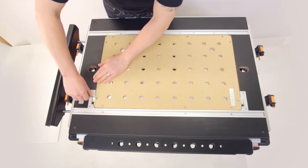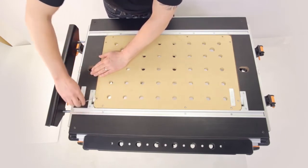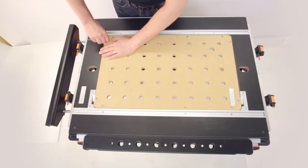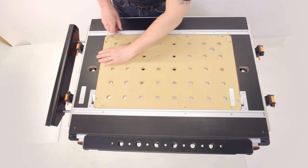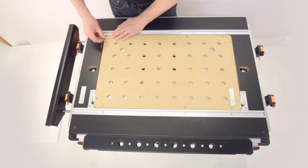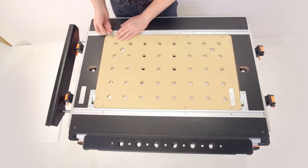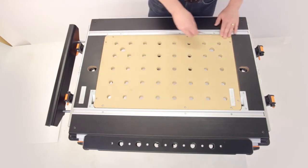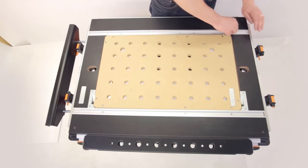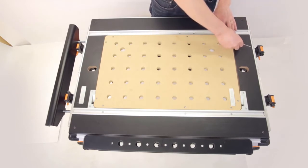The first time you fit a module to your frame, the fit can be fine-tuned by adjusting the levelling screws and the levelling bobbins, so that the top of the module is precisely level with the Workcentre surface surround at the ends and the top of the T-track along the sides. Adjust each in turn, checking the fit by eye with a set square or by hand, whichever method suits you, to achieve an accurate result.